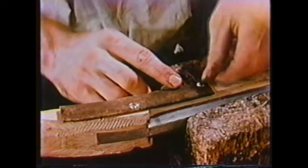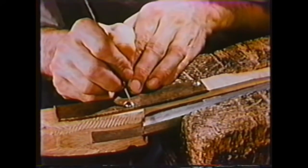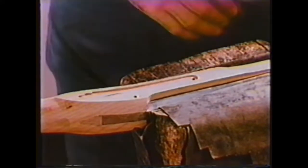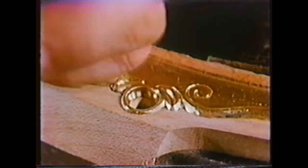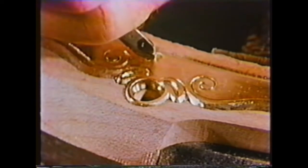The side plate, made of sheet brass, is mainly a washer for the two screws that hold the lock in place, but it's also a decorative piece. Designs on side plates vary from gun to gun, although generally they have a similar style. The side plate is inlet with lamp black the same as the other parts — afterward it's filed off smooth and engraved. A round bottom chisel is used for cutting lobes and leaves. The majority of the engraving is done with the V-shaped engraver, which cuts a narrow line.